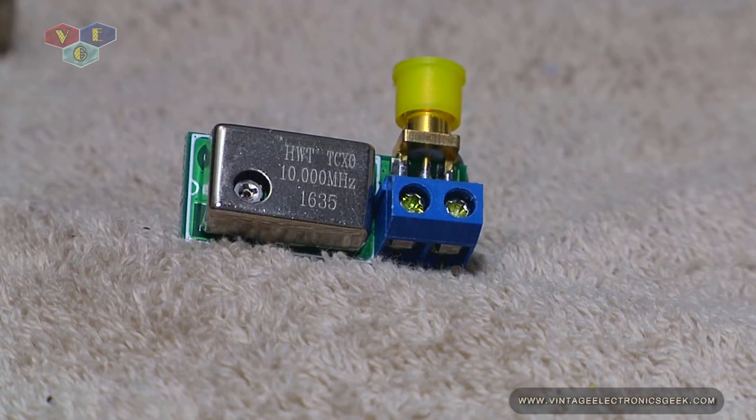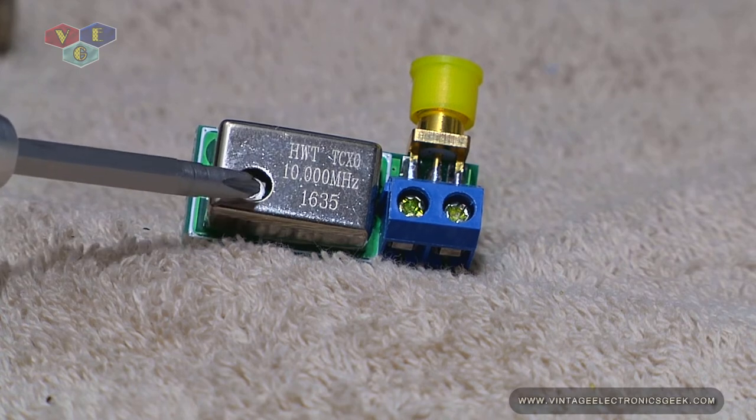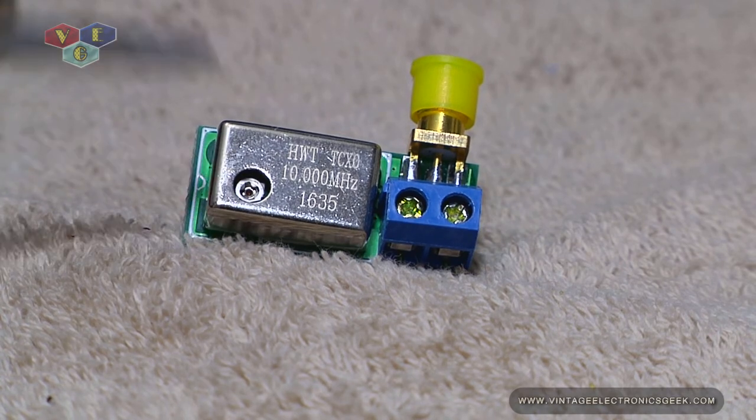I have found another item of interest which would sell for just about $100. Depending on how this thing works, I may go for that. If this one works out fine, I'm fat and happy. Now, as a crystal controlled device, they do have drift. Over time — years — the crystal will drift. And that's what we have this little screw terminal here to adjust and try to get it back on frequency.